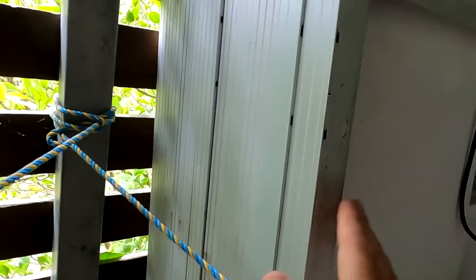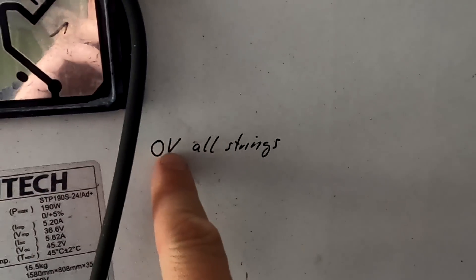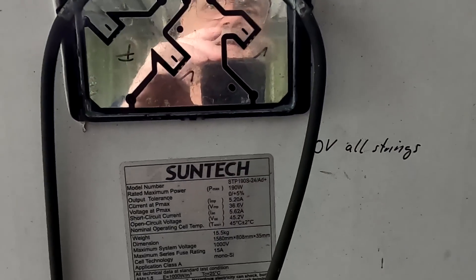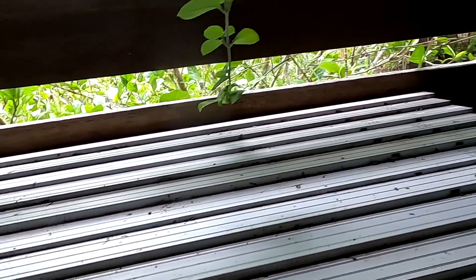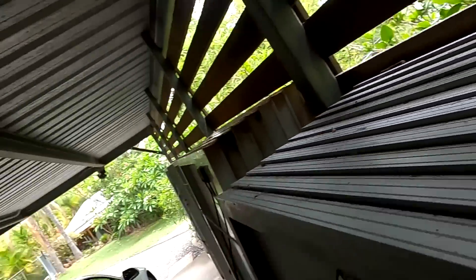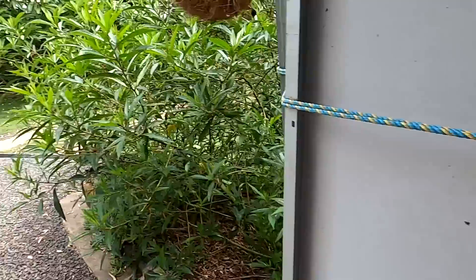And these are the 190-watt panels. We started with zero volts on all strings — we opened the junction box here and measured all these strings, and none of them produces any power. I've got heaps of them; most should have ratings written on them showing how much power they deliver in full sunlight. I checked them all with the solar panel tester.